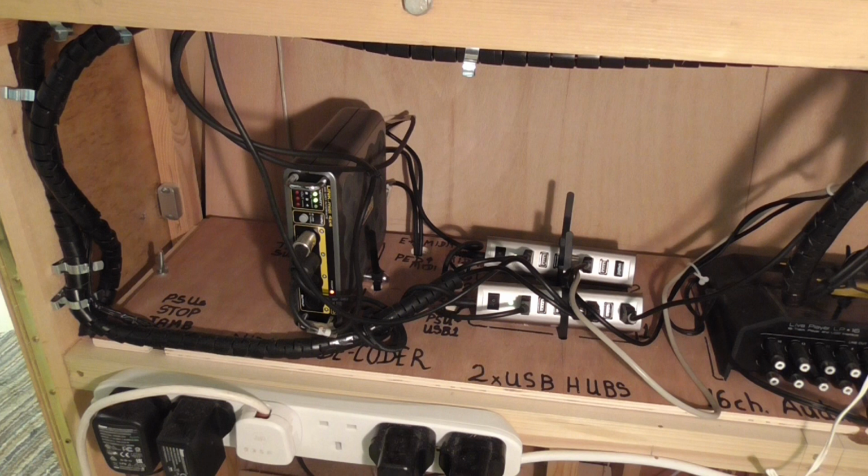The devices which connect to this MIDI hub are the pedal board and its associated expression pedals, and the left stop jam, both for encoding and decoding, and the right stop jam, likewise, for encoding and decoding. Of course, the pedal board and the expression pedals are input only as far as the MIDI hub is concerned. They only provide outputs, of course, to go into the input of the MIDI hub. There's no associated output with that. So that's the Tapco 4x4.